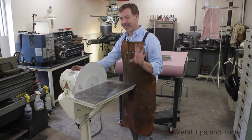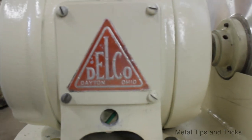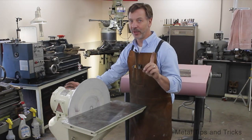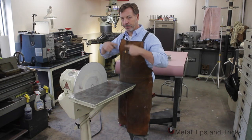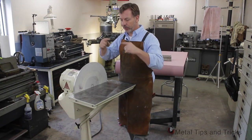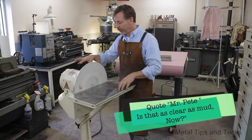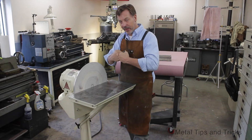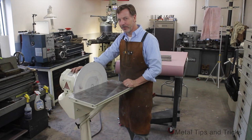When you're given a motor, you just take it and be happy. This is a repulsion induction motor and it's one horsepower. What's great about a motor like this is if you compare it to a standard induction motor, this thing would effectively come out to about three horses, where an induction motor only comes out to one. The difference is the way the armature is pushed versus pulled — a repulsion induction motor actually pushes the armature around. Like two magnets pushing against each other, instead of pulling past each other, which doesn't work as well. That's why you get so much more horsepower out of these.